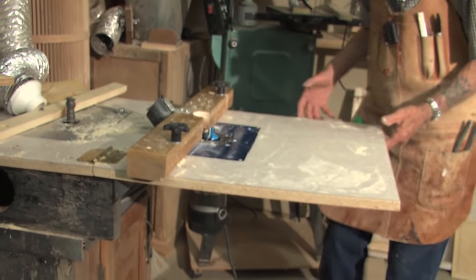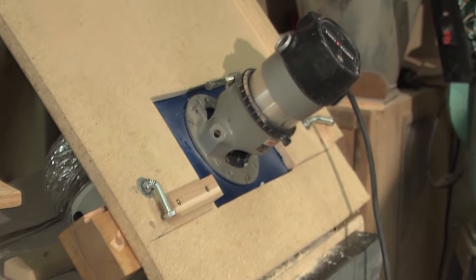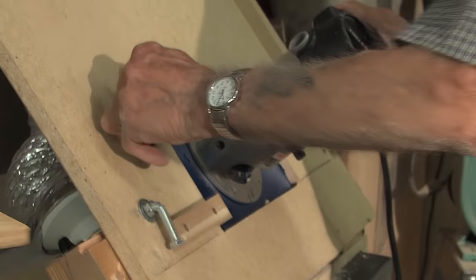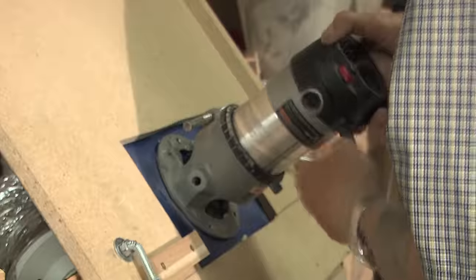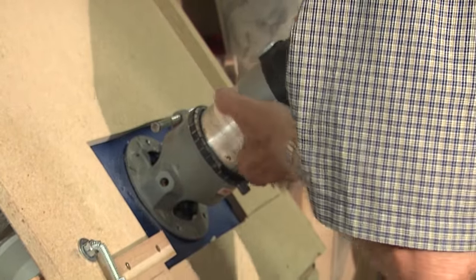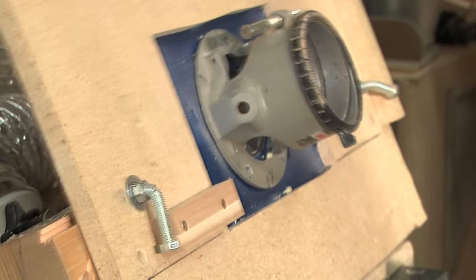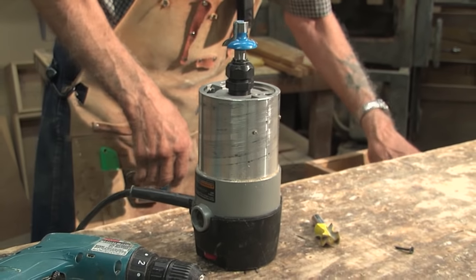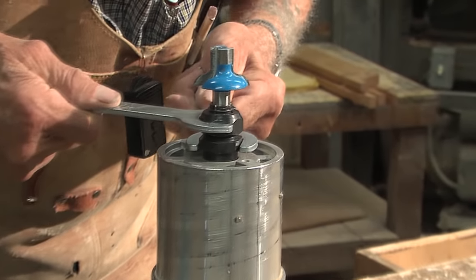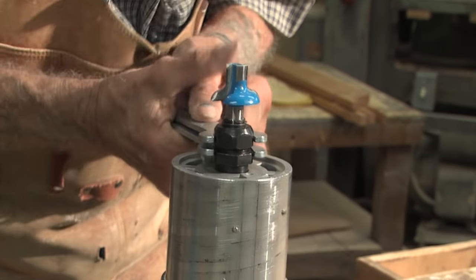When I don't need this router it's right in the way, so I just tip it up and it's completely out of the way. I take the router off very fast to change bits. I like routers where the motor screws in like this — I don't like a plunge router for a table setup because they're too hard to work with. This is an old Porter-Cable. The motor went bad after about 20 years and I bought a new one but kept the same base — that's how long they kept that same model. The Porter-Cable has a flat on the shaft so you can lay it flat and change the bit with just two wrenches. I don't like the routers with a push-button spindle lock because if that button ever breaks you're really in trouble.